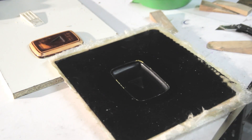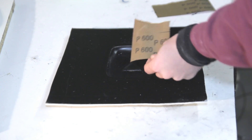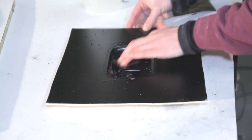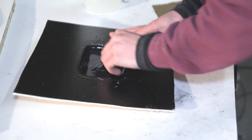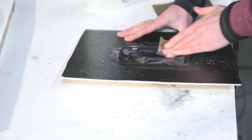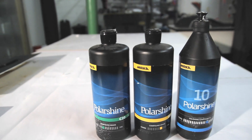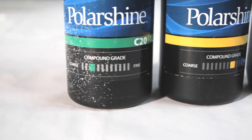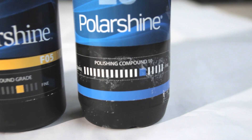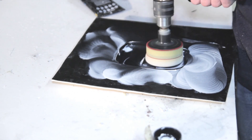There are some things about the finish from the previous video — if you have little holes in the part, these will appear as small bubbles or little mountains on top of the mold surface. You can just smooth everything out on the mold. I'm using 600 grit — I might have used a bit more — and after polishing there will still be some holes, but these can be sanded out of the part at the end. I'm going through three grits of polishing compound because I was aiming for a high gloss.